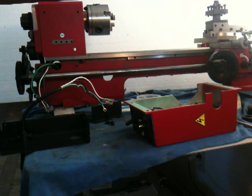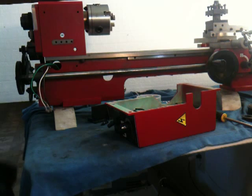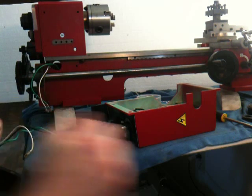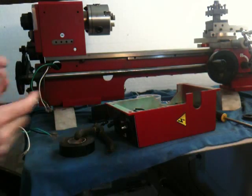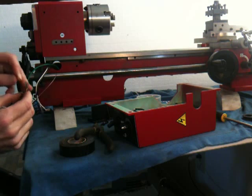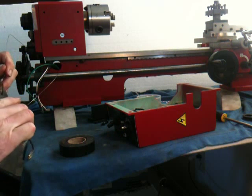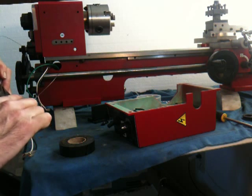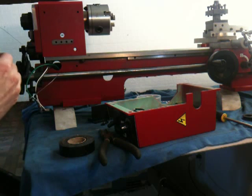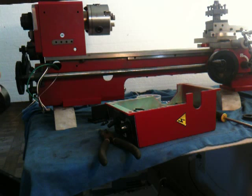Okay, the next step is putting the electricals together. I got my box and the motor cover with the power cord leads, and I got a little piece of MIG wire to make a fish tape. I'll hook it through — I already made a hook — hook it through the ground and squish it, hopefully it won't fall out. Just to make sure everything sticks together, I got some electrical tape, and it should allow me to pull everything through.